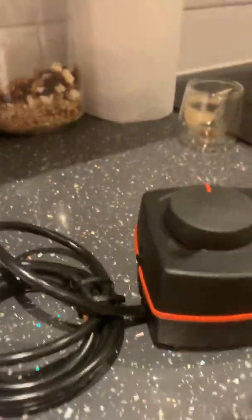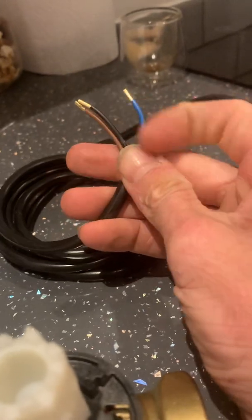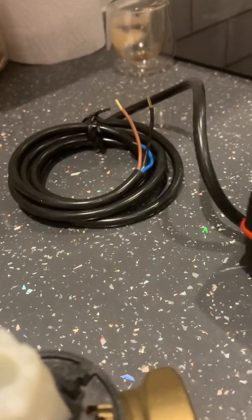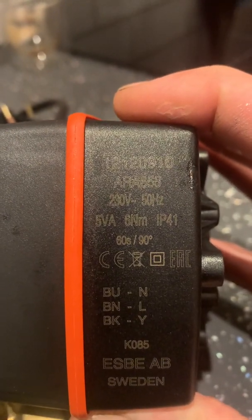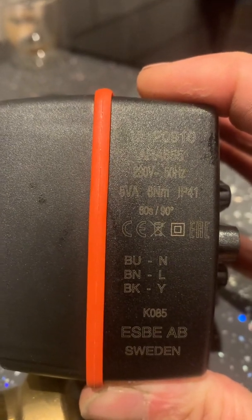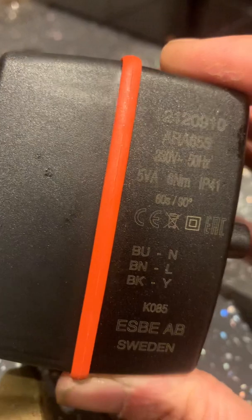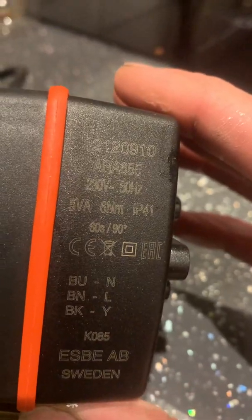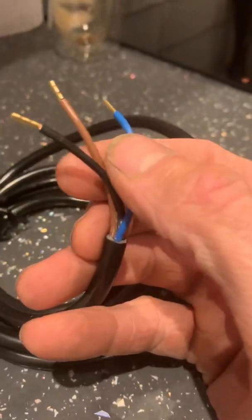When you're testing it all, wire it in — you have the neutral, and then clockwise and anti-clockwise. On the valve it tells you neutral, and then brown and black. Depending on the manufacturer — I haven't actually confirmed — but Vaillant will be clockwise one way and anti-clockwise the other. I can never remember which way, but anyway, put the neutral in and pop the brown and black in.